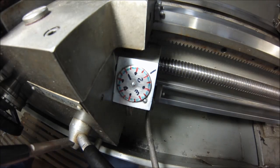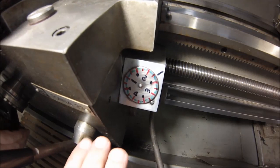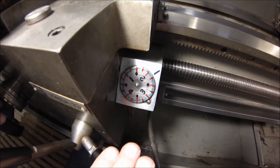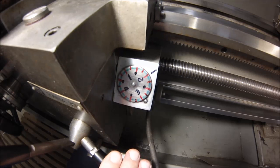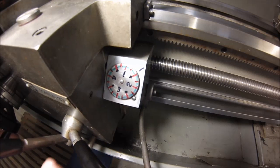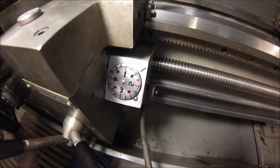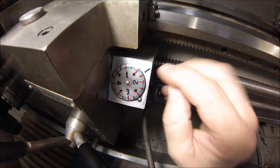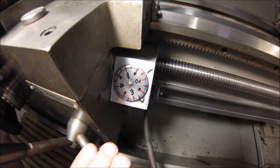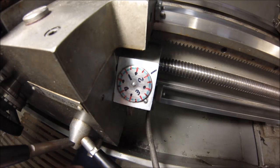If that sounded like Greek, I'm going to demonstrate it right here. Let's say we're looking for the two to come around. As soon as this half mark passes, it is okay right now to put a little bit of downward pressure on your handle and just maintain that pressure. As the two comes around, it's going to fall in. Same thing with this one — anywhere in between those marks is a good place. It doesn't matter which way you're going either. Wait for the last opportunity of engagement to pass, put a gentle pressure on the lever, maintain it — don't crush it, don't try to break the handle off — maintain the pressure, and as it comes around it will fall in naturally. It doesn't get much easier than that, guys. Try it out.